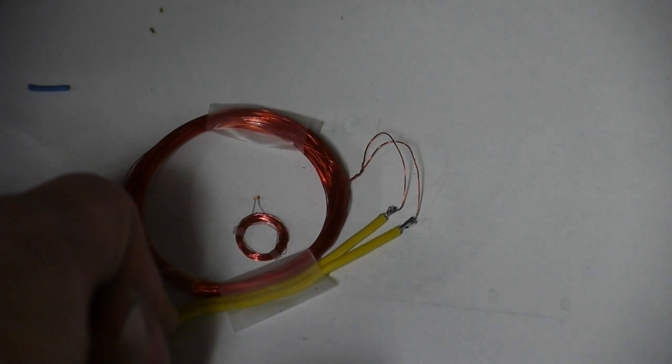I tried a few different drivers. I was hoping to switch the power on and off through the transmitter coil, which is about 80 turns of number 32 wire, but didn't have much luck with that. I ended up making a sort of spark gap transmitter. I had a relay laying around, and I noticed that when I engaged the relay and sent power through the transmit coil, I would get a flash out of the LED. I tried doing this with semiconductor switching elements and couldn't get it to work — it was actually using the spark as the transmitting element, dumping broadband noise into the coil, and eventually some frequency propagated well enough through the system to actually light the LED up.